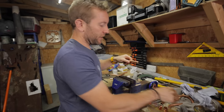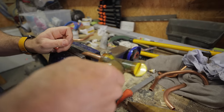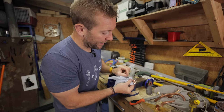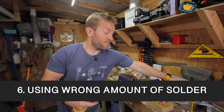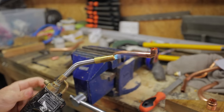Let's get this one done properly so it's actually ready for us to use. Give that pipe a good clean up, get the fitting and run around it to get that nice and clean as well. Get a bit of flux on here and run that around. If you want a really clean joint, a nice little tip: wipe off any of the excess flux around the fitting before you do any soldering. Let's light this up and get it to the actual temperature I normally do a 15 mil fitting at. I start on the underside because I like my solder to run to the underside.